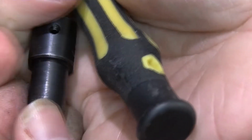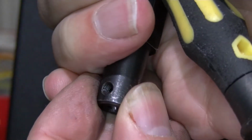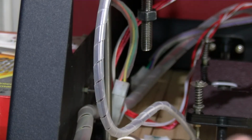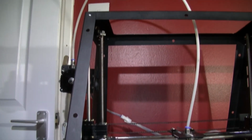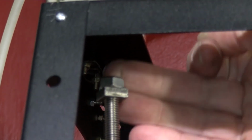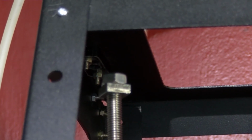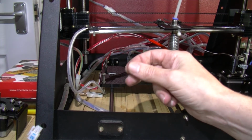So I was thinking I was going to actually have to tap out one of these holes, whichever one goes up this way. I thought I would have to tap out this bottom hole here, but I won't need to because they've already got the thread on. So that is the trick up there. Two nuts tightened against each other gives me a chance to unscrew the part on there. So I'm basically going to put this grub screw back as it was.